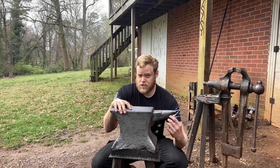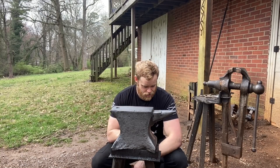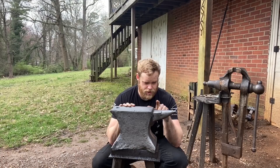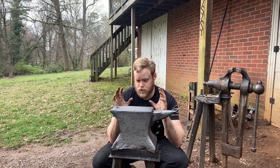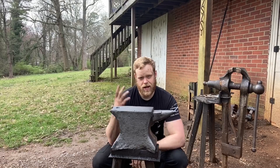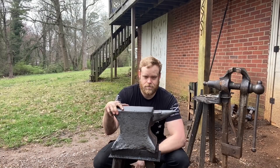No markings, no maker's marks, no weight markings have been found, which doesn't surprise me with anvils this old. I'm going to go out on a limb and say I think it's an Alsop — I had another one that was similar in shape, and a lot of anvils in the late 1700s and early 1800s didn't have cutting tables, but Alsop anvils did, which leads me to this conclusion. It could also be a really early Mouse Hole. Anyway, that's all I've got — if you liked what you saw, like, share, subscribe. Big thanks to the patrons of the channel, and y'all take care.